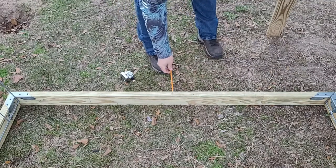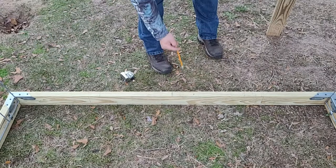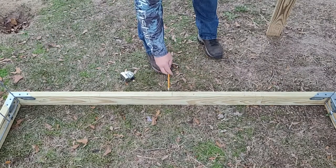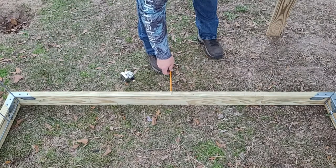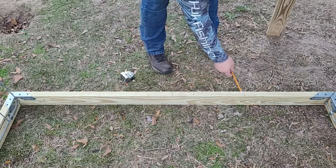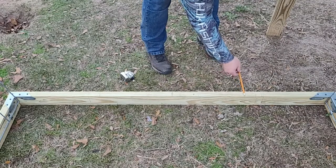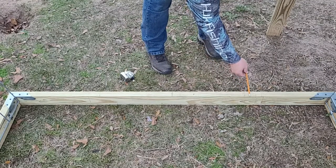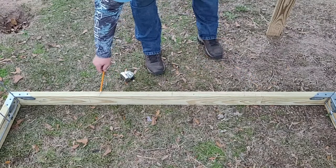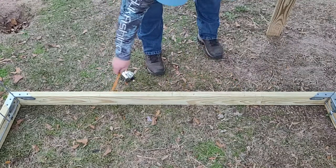This is the middle of six feet — 36 inches right here. What I do on my doors: my front post, I measure 16 inches from here and 16 inches from the other side. That'll give me where I'm going to put my board, and putting my upright on this side of the line gives me 32 inches for a door.